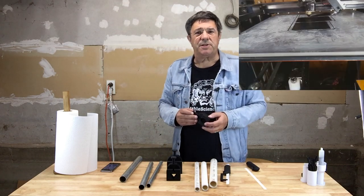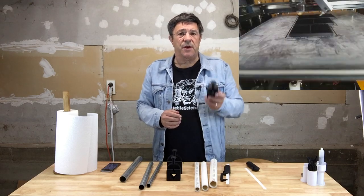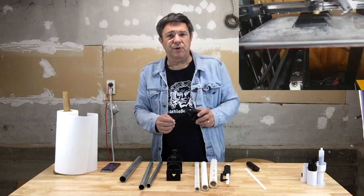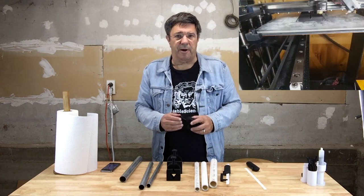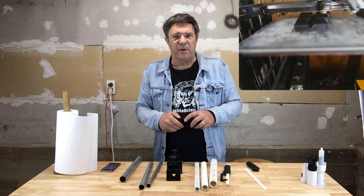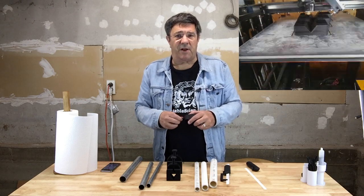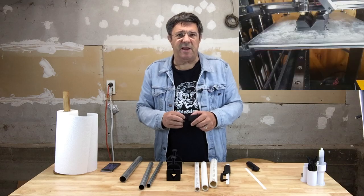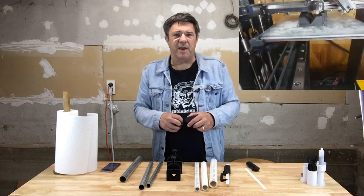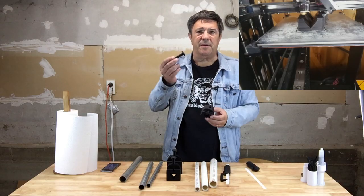We printed this project in PLA for a 0.4 millimeter nozzle, 2 perimeters, 3 top and bottom layers, and a 0.2 millimeter Z layer. We printed this in 2 parts. The box itself with a 20% infill and the clamp bolt at 85% infill in order to give the thread the extra bit of strength. So there you have the clamp and the bolt.